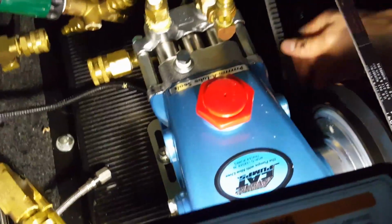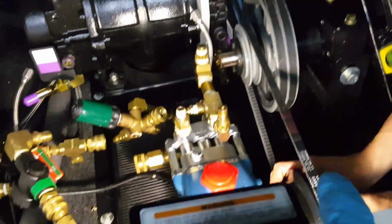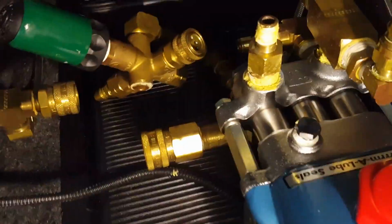We don't have this pump down solid, but we're going to adjust the pump and line it up and then snug it down to make sure we're in line and that we have good tension, but not an overabundance of tension, but good tension on that clutch and the cat pump and the belt. Okay, we've tightened down the front ones, closer to the blower on both sides a little bit. We were readjusting, realigning.